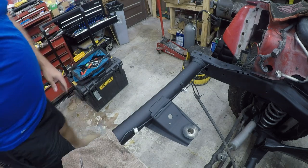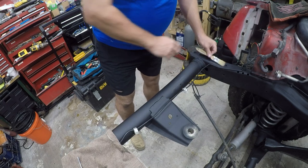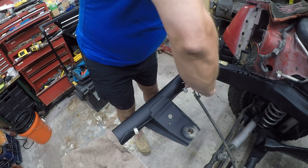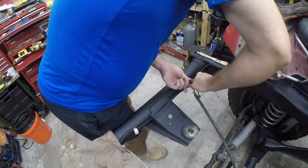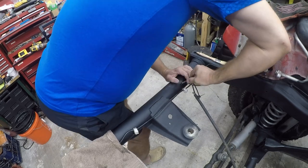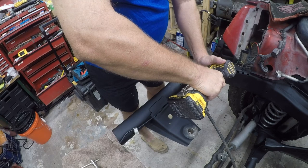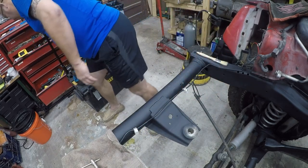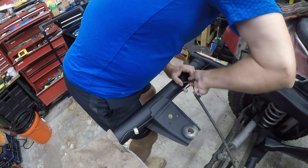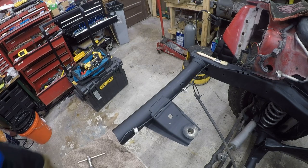It's important when you are tapping not to use a lot of pressure, because that heats up the metal on the drill bit, and that's what ruins drill bits. Yeah, that ain't gonna work. So let's see if we can make it 1/64 of an inch larger. Nah, it's not catching. Let me get my drill bits. We're gonna change sizes.